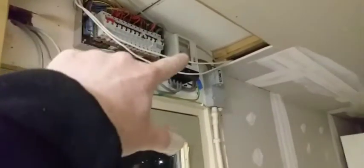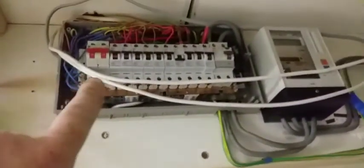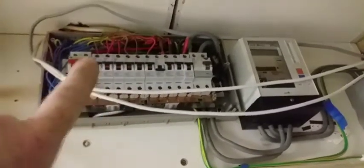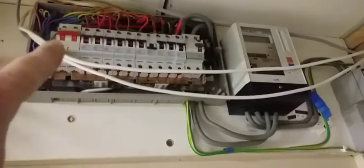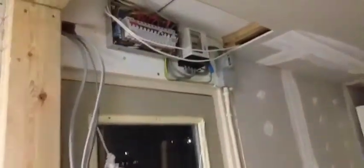That is hopefully going to get completely replaced — or it could just be a partial replacement — because we noticed that on that section there's no RCD on that section. From one to five, the first five is only connected onto that, so we may end up connecting an RCD in there and have an AFDD as well, which seems a bit odd. I'm not sure if there's a specific reason why they do that, but get another RCD and we'll be sorted.